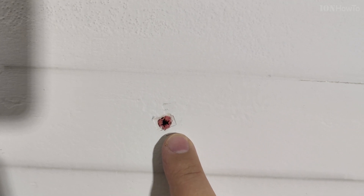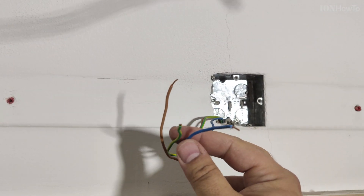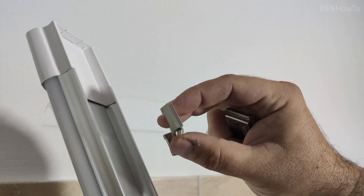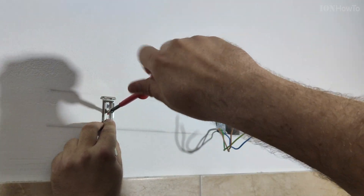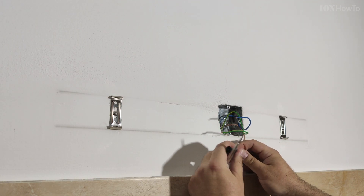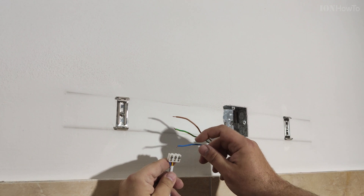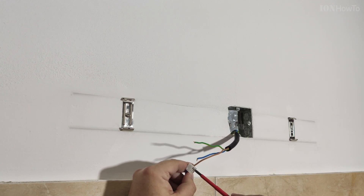In this case there was just a hole — it's the old mounting point and I'm going to reuse those holes. No need to make new ones, especially since the new fixture is easy to adjust. I'm checking the wires to make sure everything is okay. This is how this fixture installs, but in your case it could be completely different. One tip: if you're upgrading, try to get the same shape as the old fixture so you don't have to change too many things. This fixture had a sleeve — I put it on the wires for safety as required by the instructions.